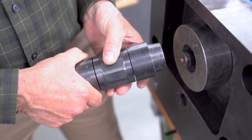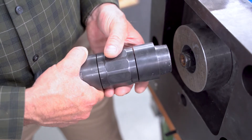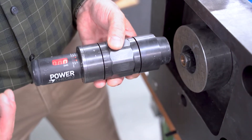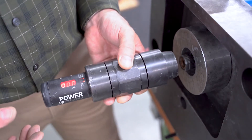We also have a tolerance ring on here that simulates the tool. We can go plus a click, which is 0.1 millimeters, or go the other direction — 0.1 millimeters — and that simulates the tool being further in or further out. This is useful if you want to set your tolerance of your positioning to the TLC.